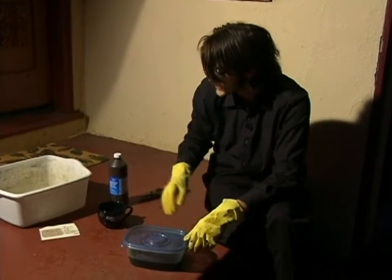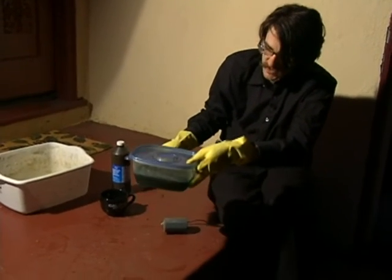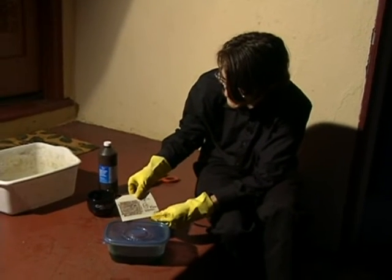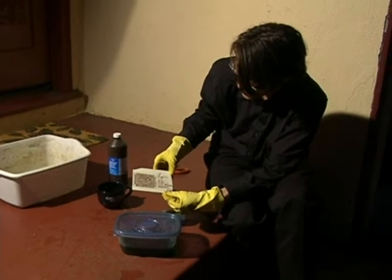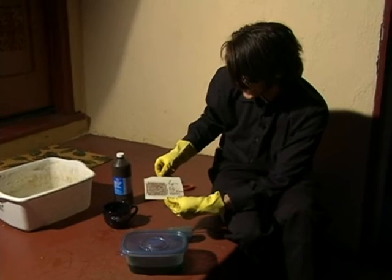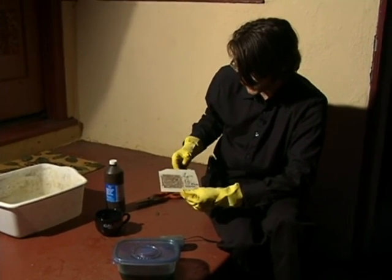If you do get a little bit down the sink, it's not so bad if it's just a little bit, but don't let large amounts get anywhere near any metal — and that includes down the drain. So we've successfully etched this circuit board and we've preserved our etchant for the next round. All this needs now is drilling holes and we have a circuit board.